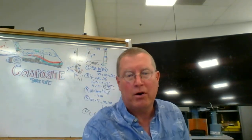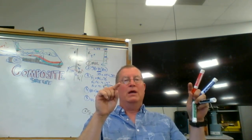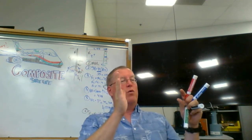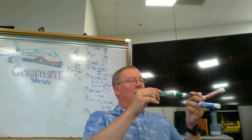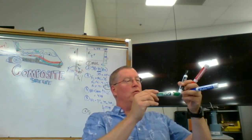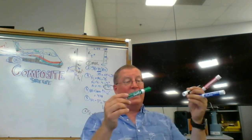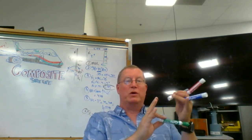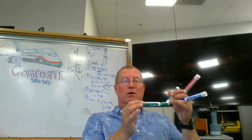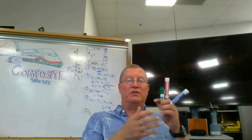After going through the six-step program: setback is that portion of the bend right at the bottom, but it's also the distance from directly below where the radius is out to the pivot point on the bending brake. We actually adjust the upper leaf of the brake back and forward to make sure we've got the correct distance from the center of the radius to where the fixed part of the brake sits. If we're bending more than 90 degrees, we need more space. If it's less than that, the spacing can actually be less. Setback is both the measurement used to calculate our flat, and the point at which we set up the bending brake.